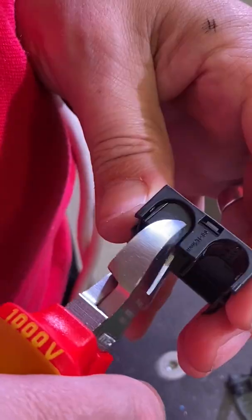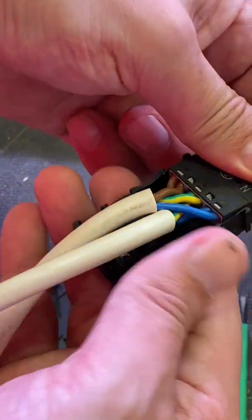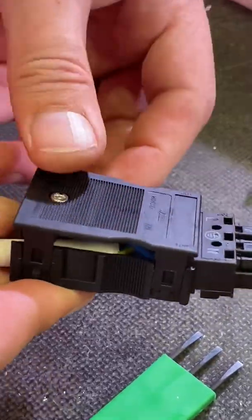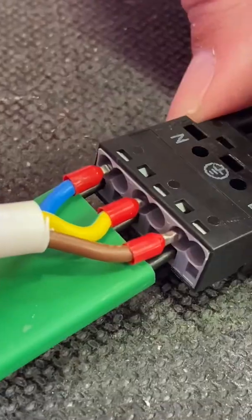Next, bring in the body in order to complete the actual connector. So just remove the ends so we can get our cables out. Push them into place. Latch the top on — you should see it click into place. Our only screw now needs tightening up. Tighten the cord grip.